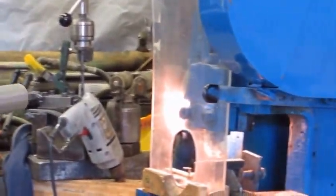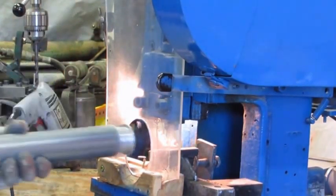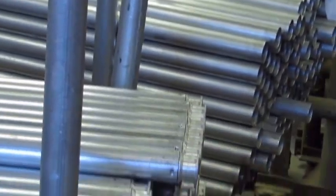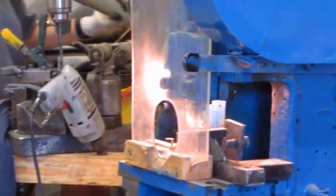And then we install a top cap, an aluminum top cap, with a punch press with two strokes of dimpling, which permanently affixes that tightly to the tube, and then to the finished storage cart. On to the next part. And the cycle goes around again.